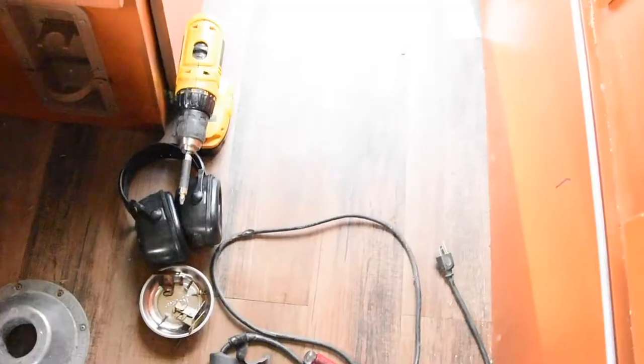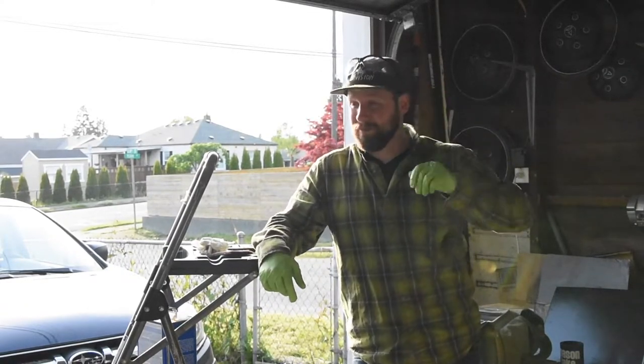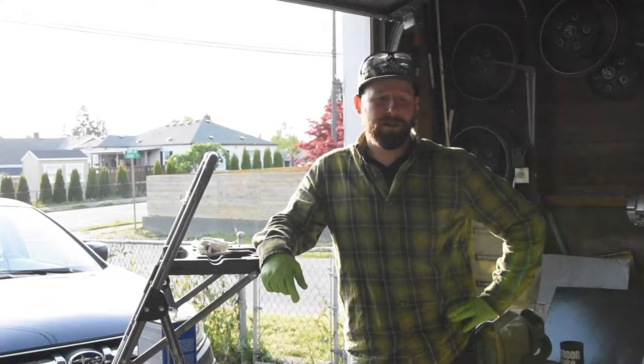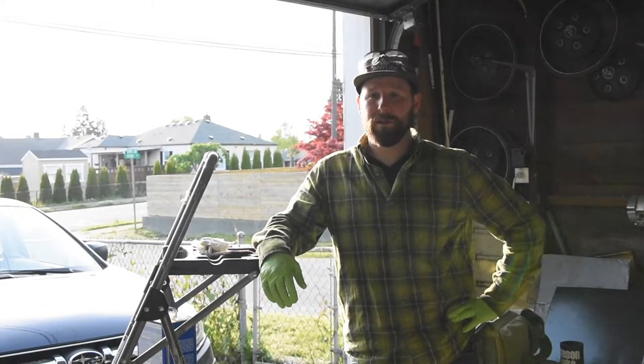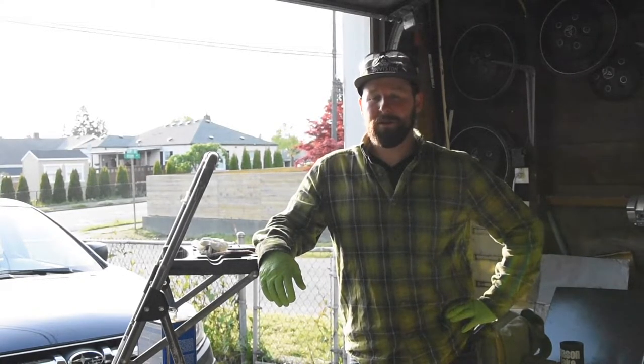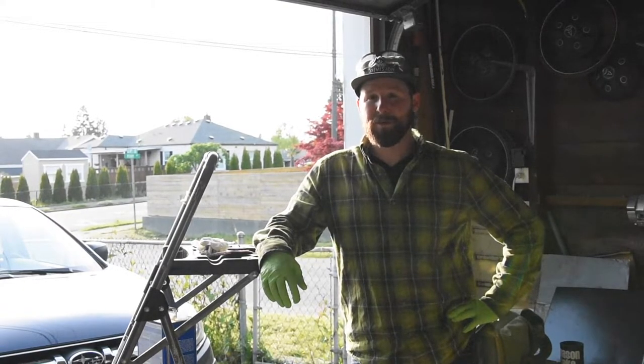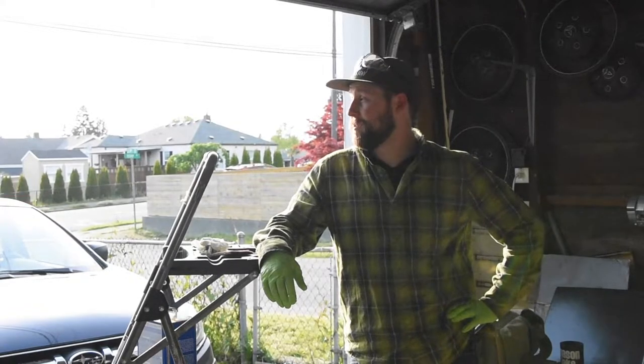You can still see that little piece of daylight right there. I thought I sealed it up okay, but I don't know. I think I'm going to just load it up and seal it — try to clean up that mold the best I can, dry it out, sand it down, treat it, probably paint over it, put some Kilz on it or something. I just hope it didn't get too much into the framing in there, to where it actually softens up and starts bowing down again, because that freaking sucks.